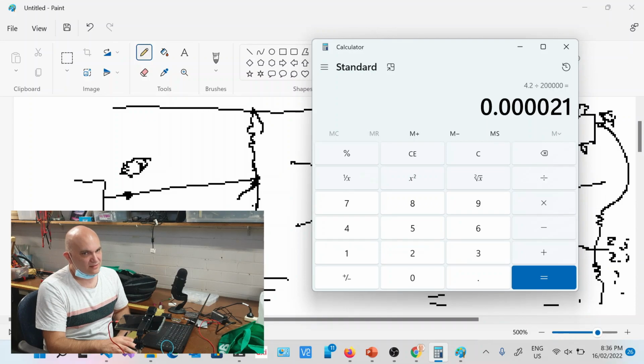There's definitely a penalty. If you were really worried about it, you could put a FET to ground and switch it out, and just look at it when you want it. You could raise it to 500k, but the more you do that, the less reliable your voltage divider is going to be. That's your price. The ADC runs out of resolution, because if you're blocking too much current, the ADC is just not going to get sufficient current.